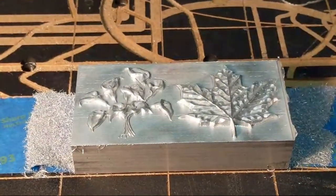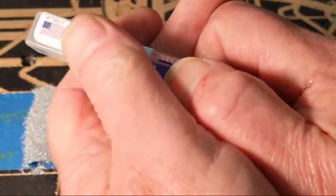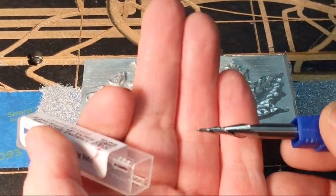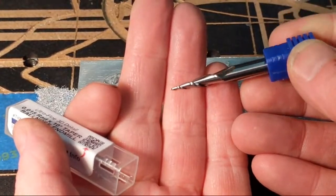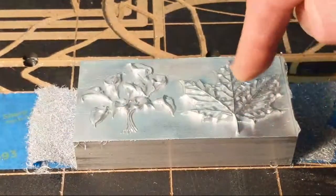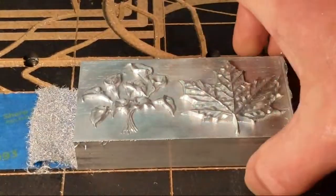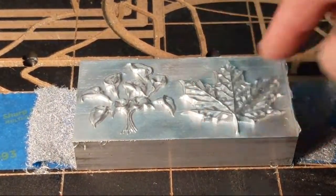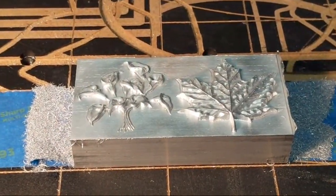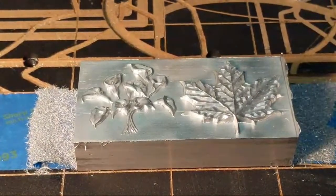The settings I used: 60 inches per minute, 5% step over, and you saw the depth, about 0.2 to a quarter inch deep, and that's it right there. So plunge didn't really matter, but it did plunge directly into it. I didn't capture the rectangle that I built outside, so it plunged down here and overran the part each way. But hey, that's what happens. Nice to stamp leathers. Oh yeah.